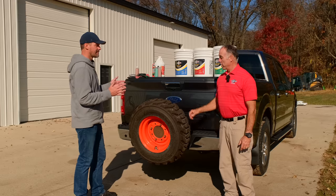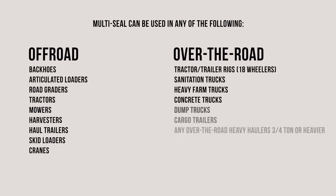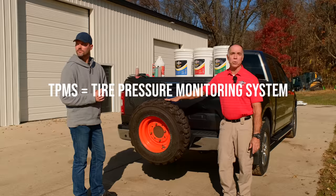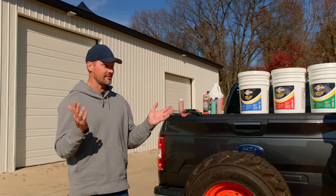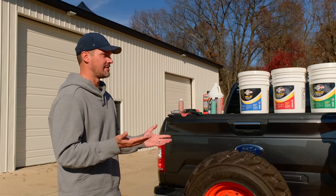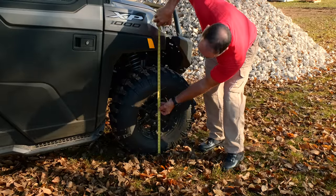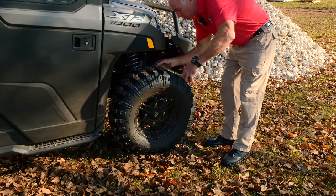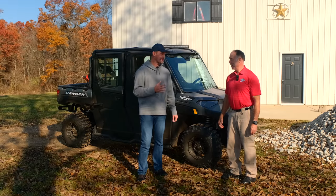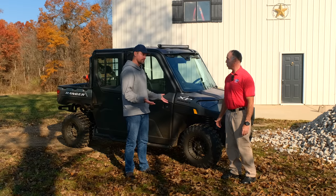What can this product be used in? Anything off-road, regardless of air pressure, size, or weight. For over-the-road use, three-quarter-ton trucks and above. Multi-Seal does not recommend use in passenger cars or light-duty vehicles due to TPMS systems. So basically everything on my homestead except my truck — four-wheelers, tractors, trailers, zero turns — yes, correct. On the Polaris Ranger, you just measure the height and width of the tires using their calculator. We needed 150 ounces for the rear tires and 126 ounces for the fronts — about two and a half gallons total, all pneumatic, so we use the Pro HD 2500.